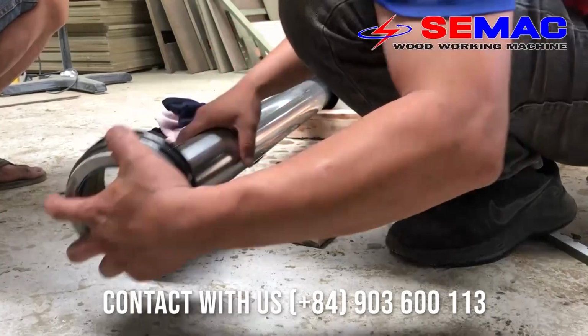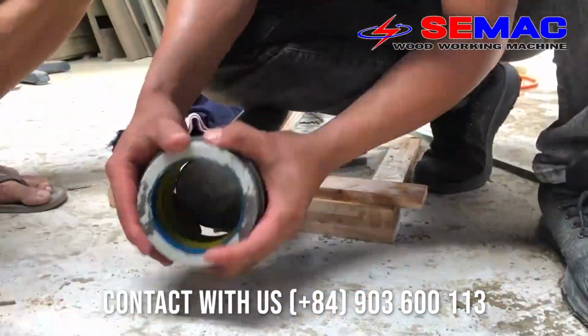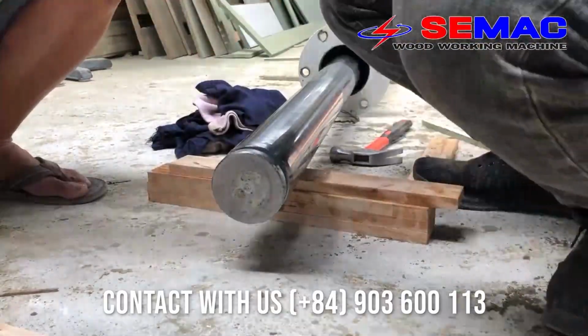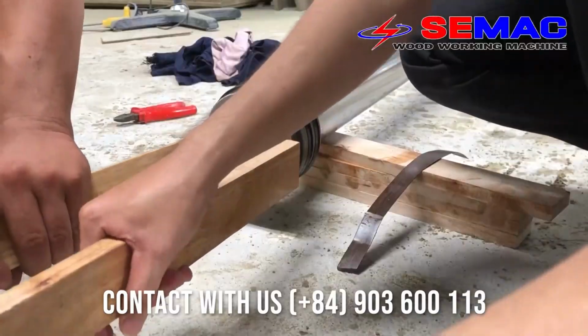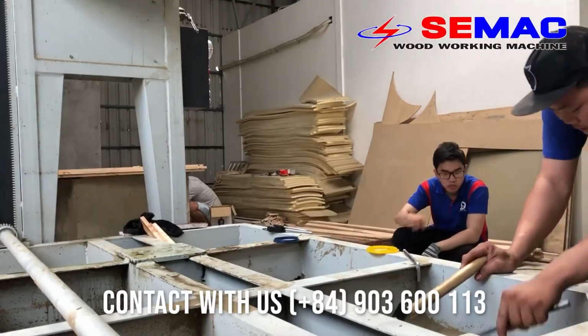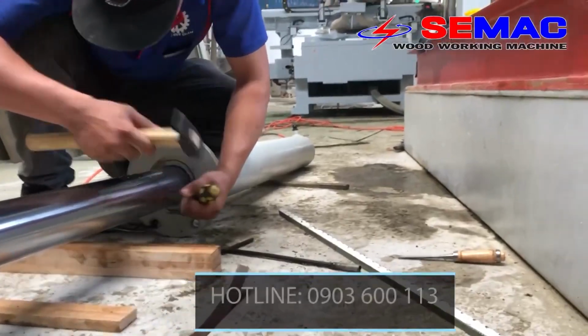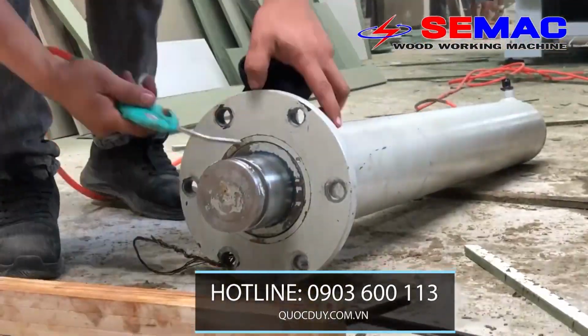However, due to the high viscosity of the lubricant, we had difficulty installing the gaskets. However, we succeeded by lifting the engine and applying pressure from above. Next, we reassemble the small parts to bring the cylinder back into the machine and reconnect the oil lines. After completing the assembly, we check the motorbike to ensure that the cylinder no longer leaks.